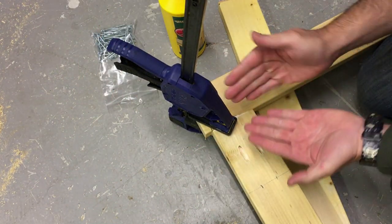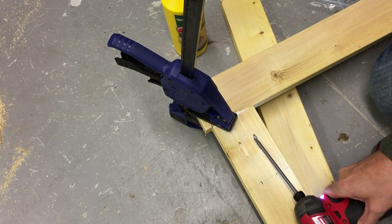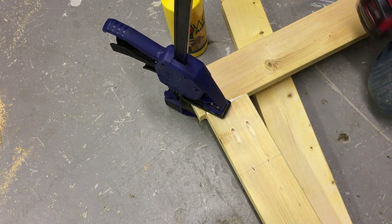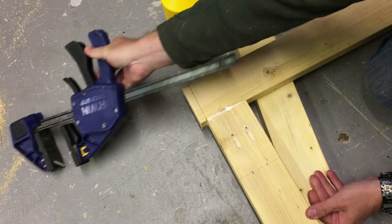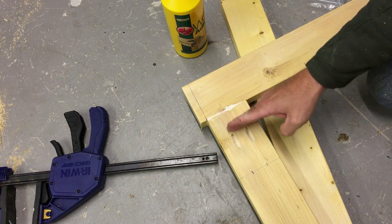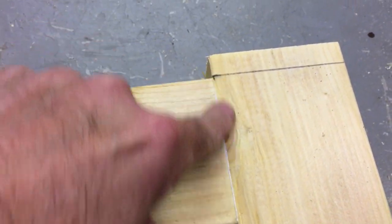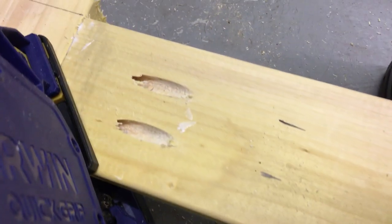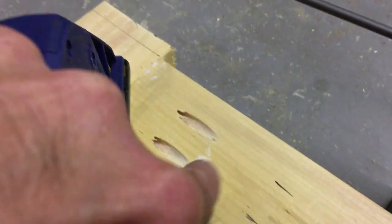The clamp here stops the timbers from twisting when you're putting the screws in. Just tighten them up until you see the glue squelch out — you don't need to over-tighten. That gives you an extremely tight and strong joint. So the finished joint: you can see how tight that is — I've wiped the excess glue off, two screws in there, glued.